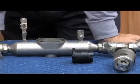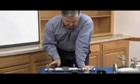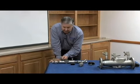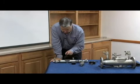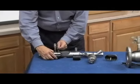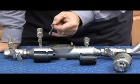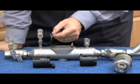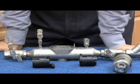or we have a problem with pumps putting in a large shock in there, it is possible to stretch that tubing. If that tubing stretches to the point where that O-ring will not seal inside that assembly, you have to replace the entire assembly. In other words, as long as that O-ring can be squeezed in that slot, and that slot can squeeze inside the body right there, this is a perfectly good check assembly. But the day that this tubing stretches out of round, or somebody puts a pipe wrench on it, or some other configuration like that where suddenly this O-ring doesn't seal on the body, then we do have to replace the entire body.